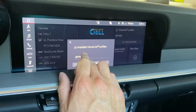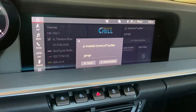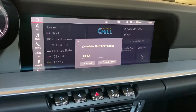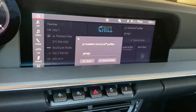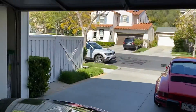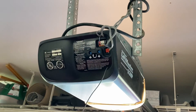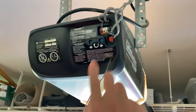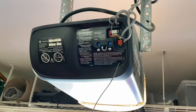If I push garage again it will send the signal. But there's one last step we need to complete in order to have everything sync up, and that is to enable access to the rolling code on the garage door itself. I'm going to go to my garage door opener — in the back of garage door openers with rolling codes there should be a button, and when you click that button it will enable access to the rolling code. You know it's activated when you see a light turn on when you push the button.